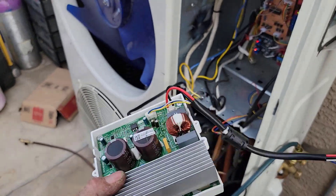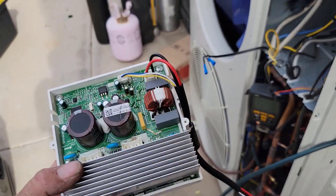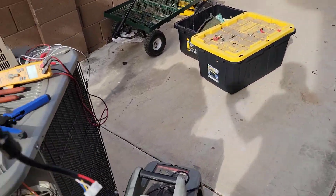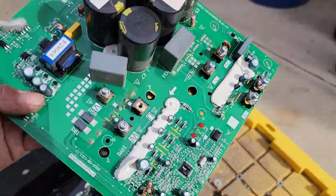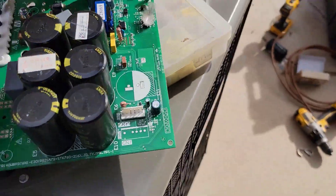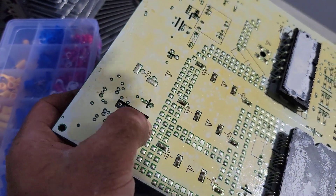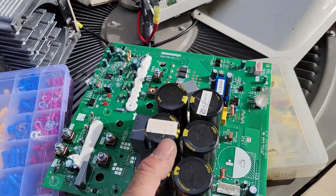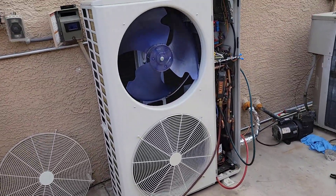The only thing I can think of is this motor driver taking a shit. I don't know if I have close to 250 volts out here and just going through the diode - maybe that voltage was conditioned. The way those hook up in here is this inverter board takes power off the rectified DC bus right here. I can see the traces - there's plus, there's minus, high voltage, it's just going to come off of here. I wish I could have driven this thing directly but it just communicates. So now I'm stuck - I don't have fans.